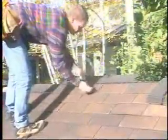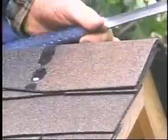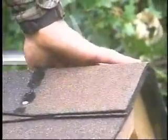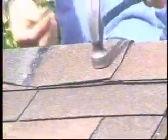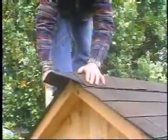The top row of shingles that overhang the peak can simply be folded over and nailed. The final step to the roof is nailing the caps into place. Evenly space the caps over the ridge and place 2 nails into each cap. Cut the overhang off the end caps so they fit.